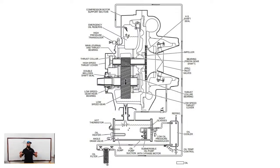So very stark difference. But again, that impeller is a fraction of the size, literally half the size, if not smaller, than this for the same tonnage machine. We're just talking about 400 or 500 ton machines here. In order to achieve it, they all move the same amount of refrigerant, and they can process the same amount of BTUs. They just do it different ways. There's advantages to both. One of the things that I see is the York design tends to be more efficient and can handle some pretty unique load scenarios.